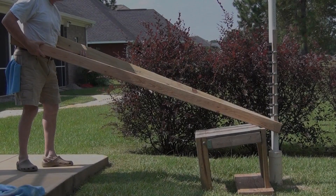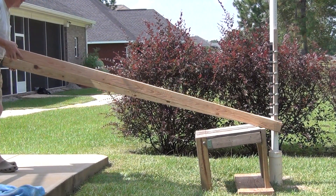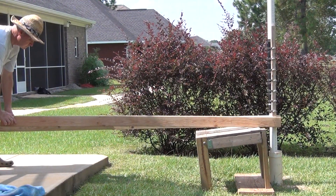Then I use a bunch of pipe clamps to attach a piece of oak to each side of the pipe. The bottom of the pieces of oak become excellent points to use in prying the stuck pipe up and out of the ground.